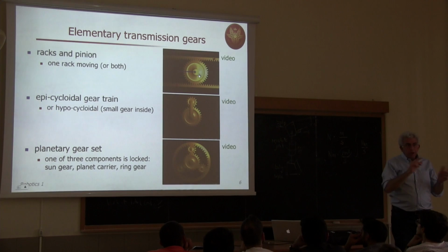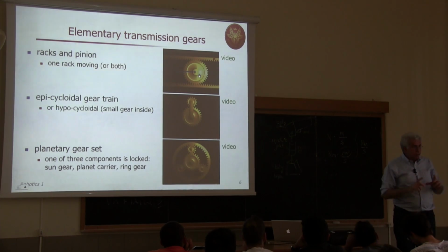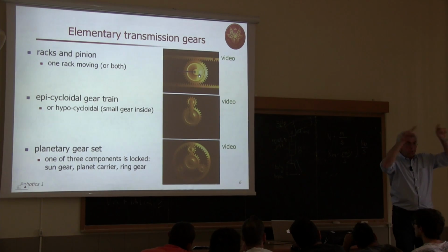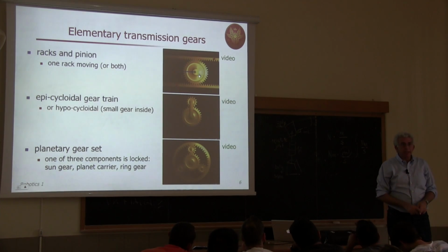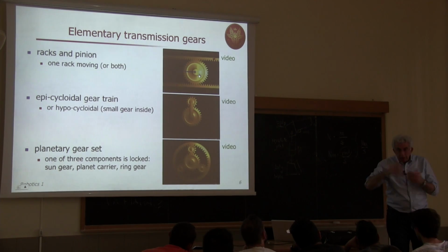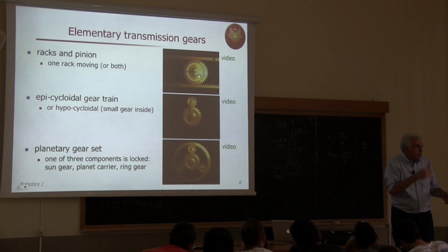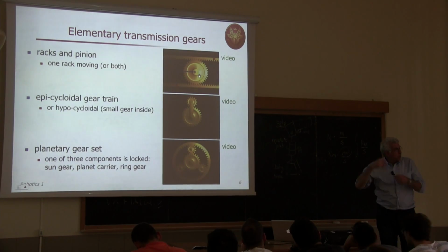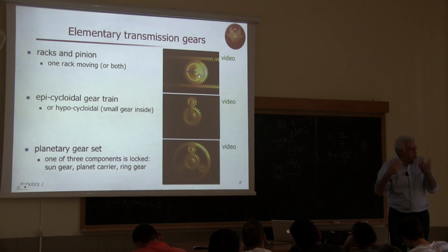And also, you can have a scaling factor depending on the radius of this wheel, so on the number of teeth that you have on the external circle. You may have that one rotation of the wheel is equivalent to some displacement. And by changing these numbers, you change the ratio between angular motion and linear motion. And you obtain already a kind of reduction.